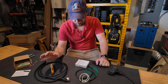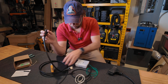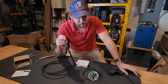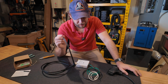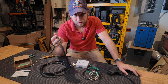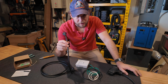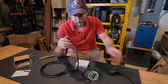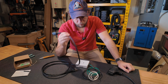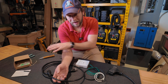As a little test to demonstrate, I'm going to take this little extension cord and wrap the sensor wire around it. Now, this is a fairly difficult task because this is a very small conductor and nothing like the conductors coming into your panel. The extension cord has two wires in it — the neutral and the hot. If this were a current-carrying conductor, it essentially wouldn't work because the currents would cancel each other out and you'd read zero even though current was flowing. But I'm not separating out the hot and neutral here, so we're going to give this a try and see if it can pick up on the voltage like the sensor pin does.